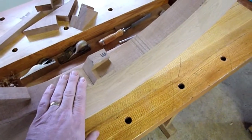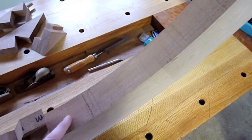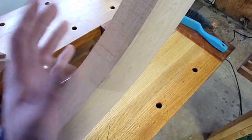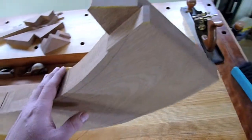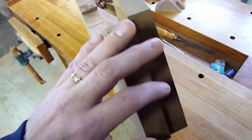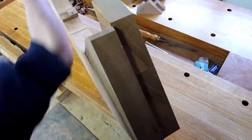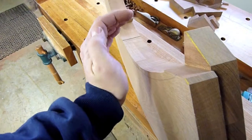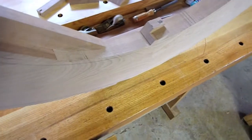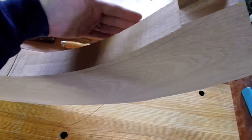We use solid boards with a single glue joint in the middle. Depending on the species of wood, sometimes it's possible to have a solid wood door without any glue joints, but in this particular door we're using mahogany. It needs to be extremely flat because it's going to a somewhat humid climate, so I don't want the door to be doing any warping, curving, or whatnot — we want it to remain nice and flat and straight.